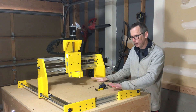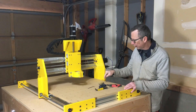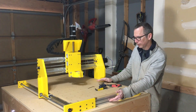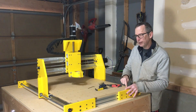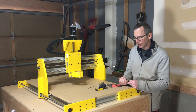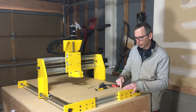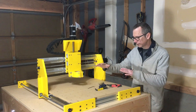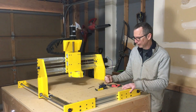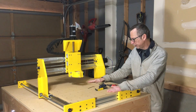I also made a waste board. This is just three-quarter-inch-thick MDF board. I drilled and countersunk 12 holes to mount the board to the extrusion table underneath it, then I drilled roughly 120 holes on three-inch centers and chamfered the backside. I'm going to install M5 threaded inserts from the backside, and that will serve as the clamping system. I'm just waiting for those M5 inserts to arrive, and once they do I'll permanently mount the top of the table.